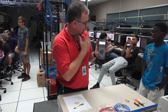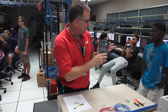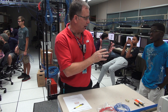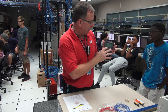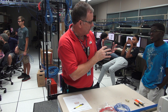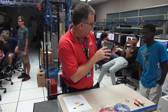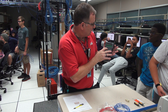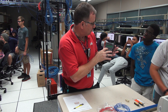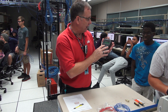If I push enter, it will move to the next thing, which in this case is wiring — we're selecting the standard. This one is set up for EIA-TIA four pair. And if I hit the down arrow, I can also select 10BASE-T, two pair, token ring, TP, PMD, and USOC. There are a lot of settings on here, but the one we use for our purposes in this lab will be the EIA-TIA four pair.